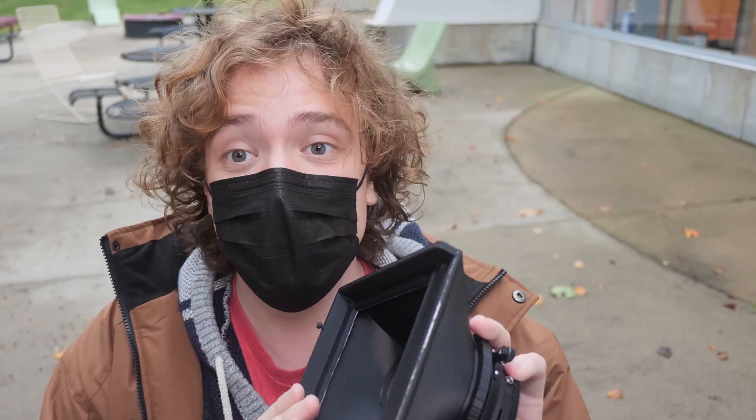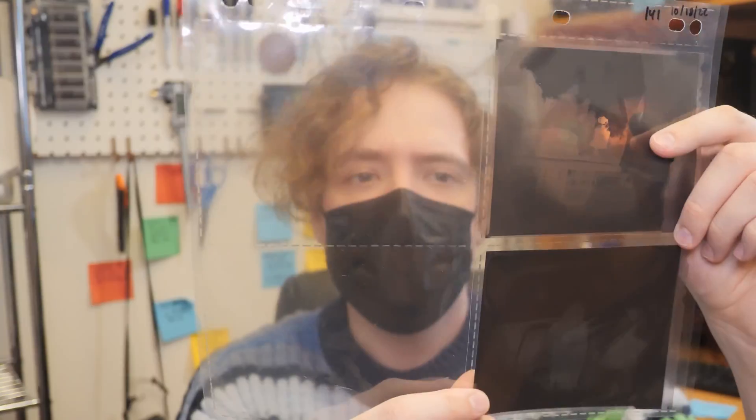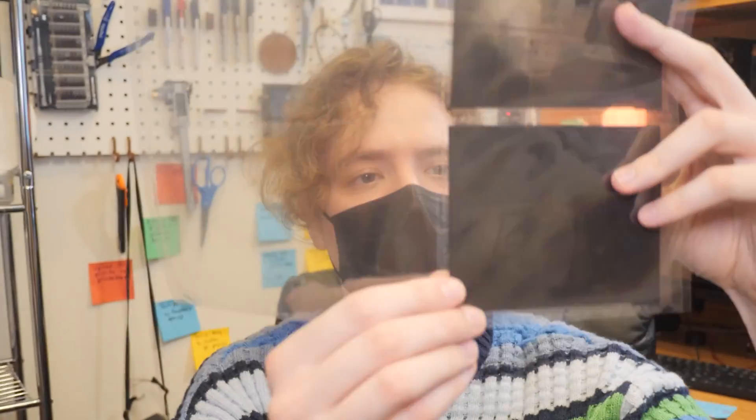I think this is going to be pretty neat. I have some film that expired in 1969, type 4147. It is raining. I guess I'm going to do some exposures and hopefully stuff looks fine. This is very much incomplete — there's no way for the film holder to hold itself in. First results are pretty promising. There were a lot of problems, especially the flange distance was wrong. I have to move it like a millimeter back to get it to focus — that's the only thing I had to get right basically for this to work, and I screwed it up.